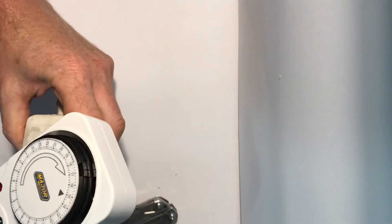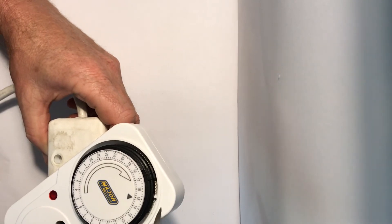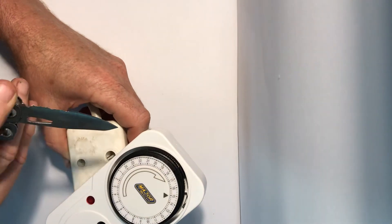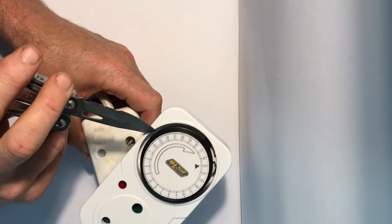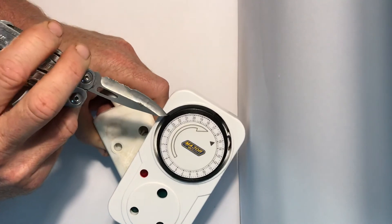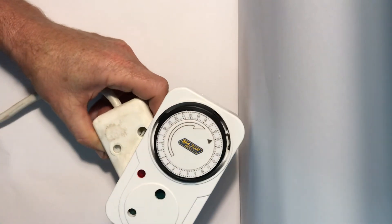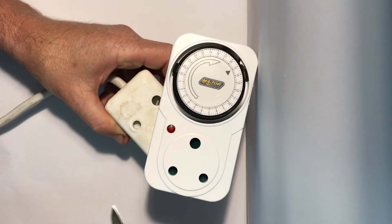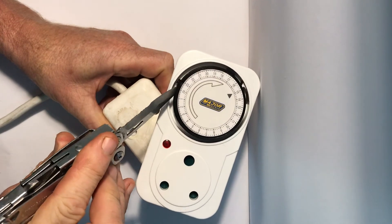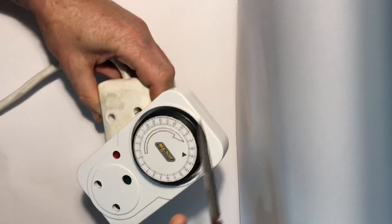You'll see that the timer clicks every 15 minutes. When it comes to those four slices, it'll switch on and your pump will run for two hours. You may also decide you want the pump to run again at 11 o'clock tonight — 2300 hours — so you flick those slices down. The minimum cycle you can set is 15 minutes on, 15 minutes off. Very simple, very low technology.